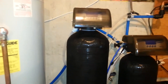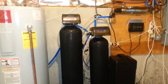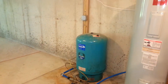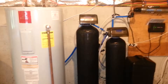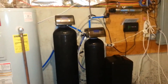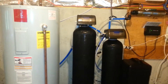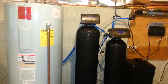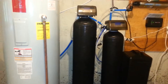The former filtration company had put a 12-inch filter in here with iron media, which was quite dense. The well pump was just incapable of producing enough water to vigorously rinse that filter out, so it got completely clogged with iron. When you compound that issue by putting on a micronizer venturi — which slows the water down even more — that tank was just never going to get enough flow during the backwash cycle to lift the media up.